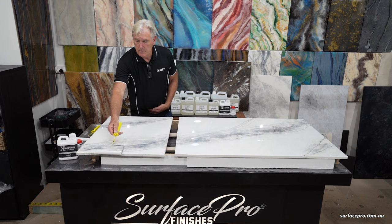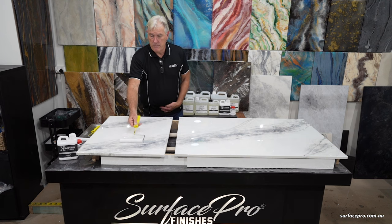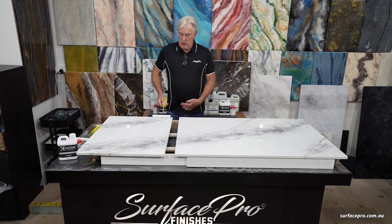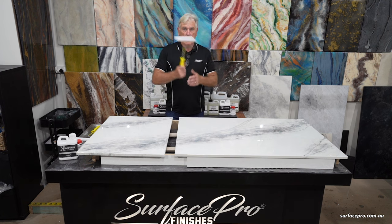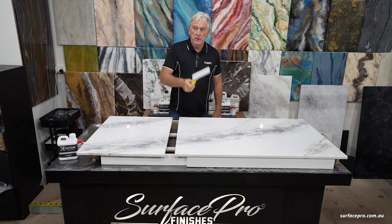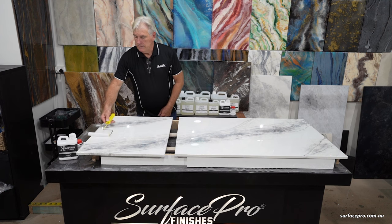That's number one. Number two, and I'm just overlapping by about 20 to 30 millimeters. Number three. Number four, I've overlapped that a bit and I've got just a little bit more to go. It's okay, I can go over that again, right to the very edge. Number five, I've done that in five goes with the wet roller. Okay, pulling that down. Now I'm bringing out my dry roller. All the dry roller does is exactly the same pass. Dry roller, number one.